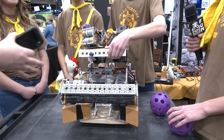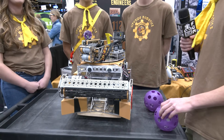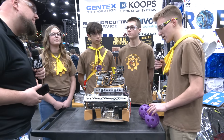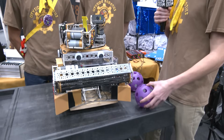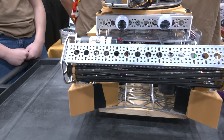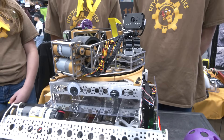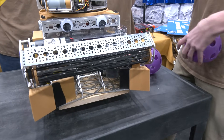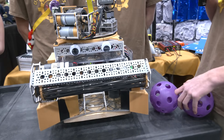You talked about how you came up with a different way to make sure that the artifacts don't jam. Are there any other key difficulties that your team faced and how did you overcome them on the front end of the bot? Previously we had a coupler on a shaft to connect these two right here, and we changed that. We also added a brace because our intake snapped once in competition. So we added a brace here and changed the angles on our intake to make sure that two balls can fit in without it needing to be moved in and out again.